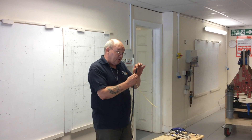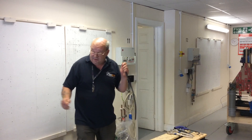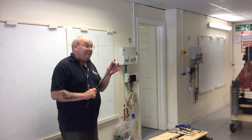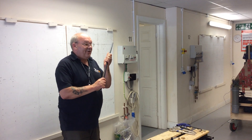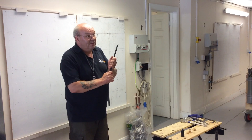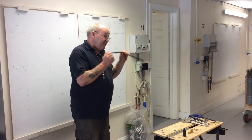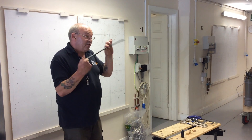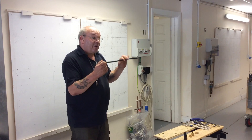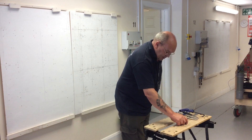You've got a CPC inside already, but think about when you're actually using this — if you bury it and someone hits it with a shovel, what's the first thing it's going to hit? Apart from the plastic outside, it's going to hit the armour. So if it penetrates the armour, you're already connected to the earth point. And bearing in mind it's an outside circuit, so it will be RCD protected — as soon as anything happens inside, it's going to trip. So those are our constituent parts.